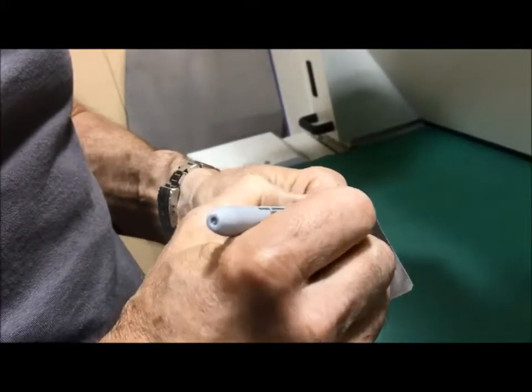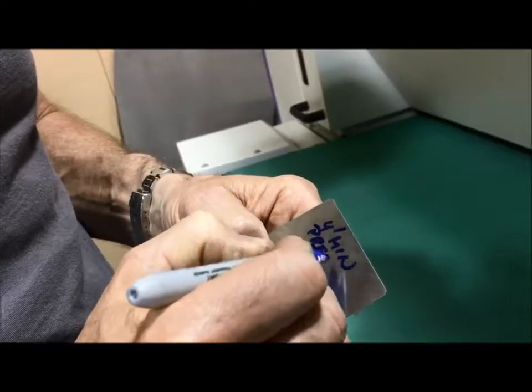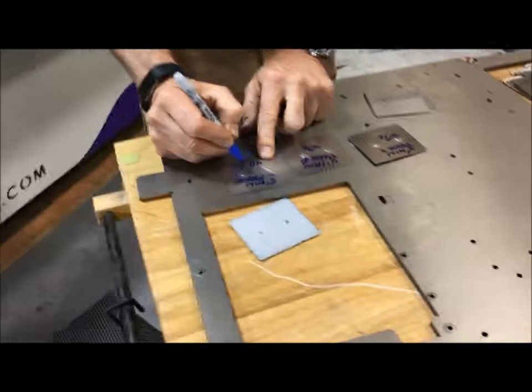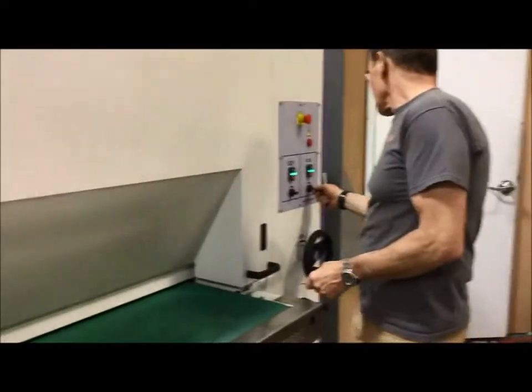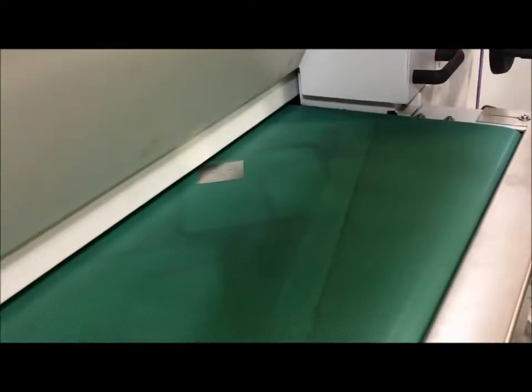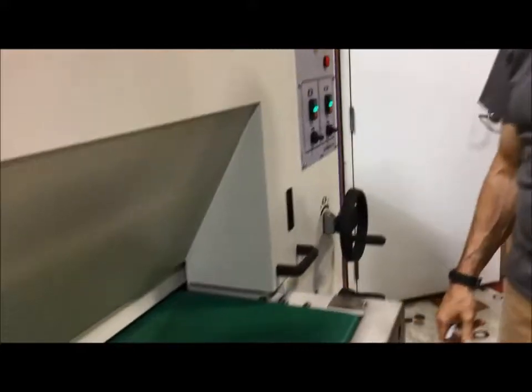So this was still 4 feet per minute. Pressure now was even a plus, let's say, and 70%. I forgot to note the percentages before on the other part. So these were 40%. There we go. So now we're gonna go a little bit slower even. We're gonna go 3 feet a minute. You can see I'm kind of picking the same spots on my belt, all parts of the central cord. Keep it 70%. And we go 1 notch higher.